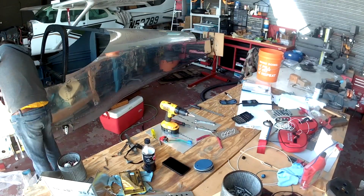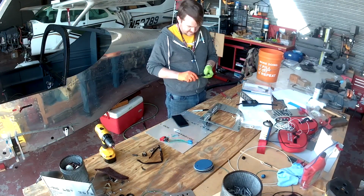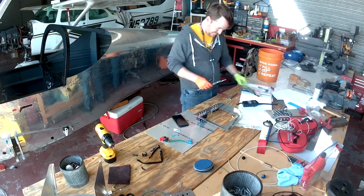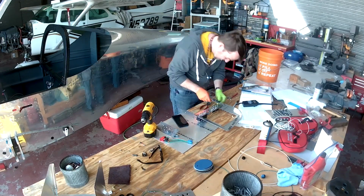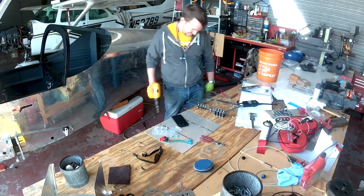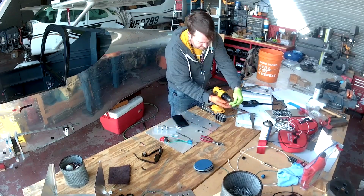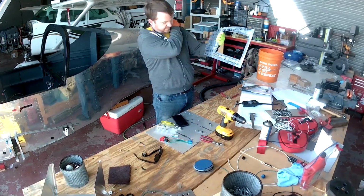Ultimately, these panel pieces that I'm working on, if I don't cut them absolutely perfect, because this is what everyone's going to be seeing all the time when they're in the plane, like if the switches don't line up and stuff like that, what I'm going to do is wind up just getting a version of SolidWorks. It's basically a CAD package, and you can get a student version from the EAA. I will simply take the spec files from Vans, because Vans has the panel dimensions in their own specific CAD files. I will take those and lay out all my button holes, and I will just have someone laser cut the damn thing.